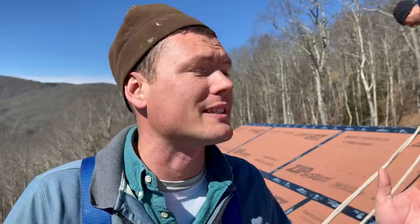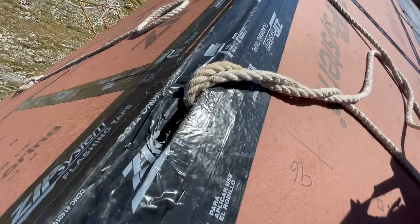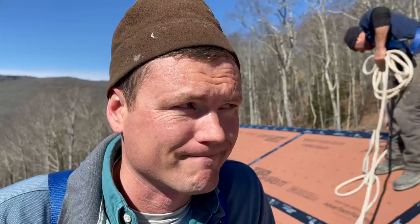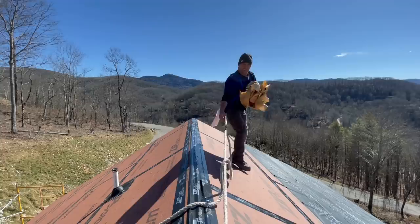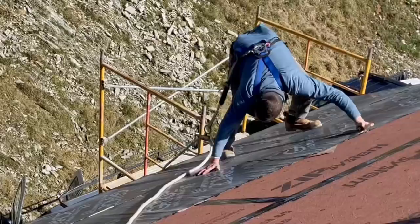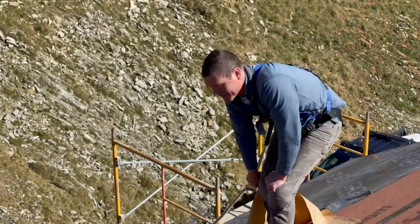The insulators called while they were installing — it was raining that day — and they said, 'Do you really want us to insulate today? You've got some drips in the house.' I said yes, do it. We have some holes cut in the roof to anchor our harnesses and those can't go away until later. It reminds me of a story where a homeowner came into a house that had the roof on but no finished roof surface — he'd circled with a marker every drop of water on the subfloor across the whole house. If you're a builder and you have plywood on the roof but it's not done, don't expect it to be 100% drip-free until you put your finish roofing on.